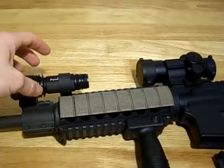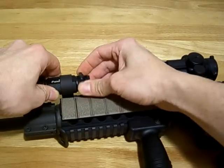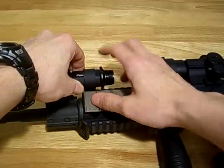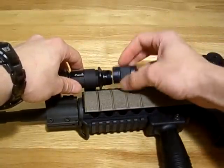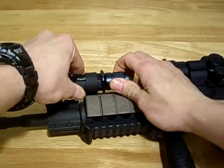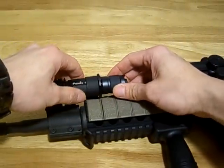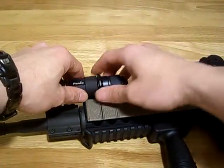I'll just slide that on there and put the spacer back on. There's a little washer between the two sets of threads for this spacer and the cap, so you just got to find it and push it in. Batteries in, tail cap in — popped all the way. I usually lock the back with a spacer, thread it back until it locks the cap on. You can either push it all the way or not, but I push it all the way. To unlock it again, you're going to have to use the Allen wrench to push it back.